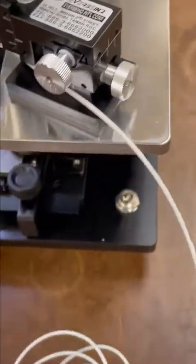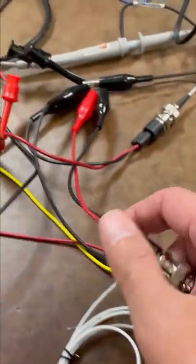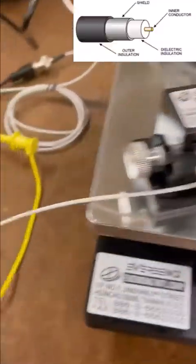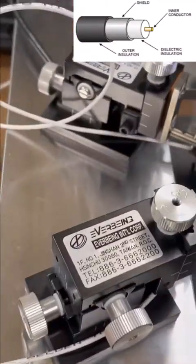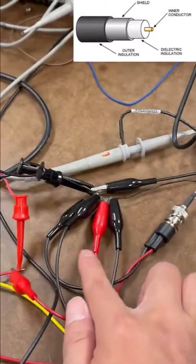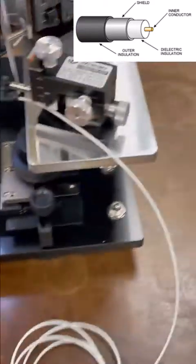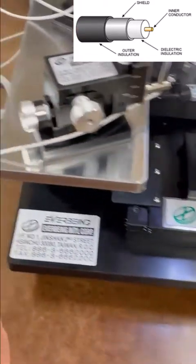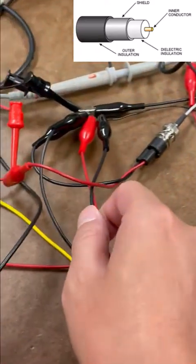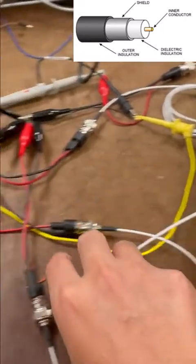Let's take a look — this is a coaxial cable, and we use this splitter to split it into a signal and ground. All of them are coaxial, so each has two outputs because of the ground plane. We need to connect all the grounds together. For this particular probe, we want to make it the ground, so even the signal itself is grounded.